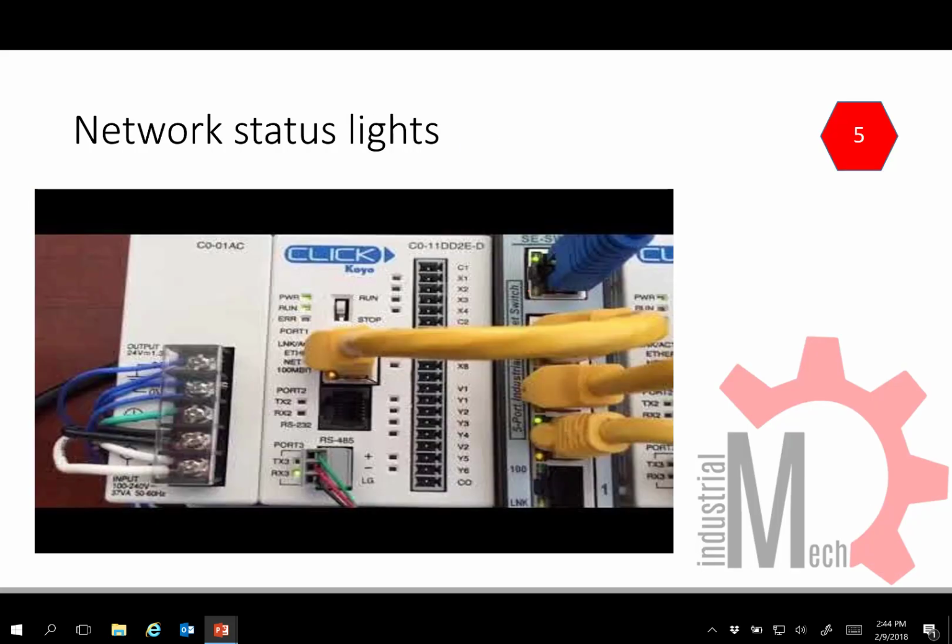The network status lights are simply lights that light up, and there's a video you're going to watch that shows the lights activating, and those lights allow being able to see it, and if that pattern changes, you're going to see that means there's something changed in the network. Probably a device is not communicating, the port is bad, more likely the cable's not hooked up. The other thing about these lights is notice their rate, and they should stay the same.